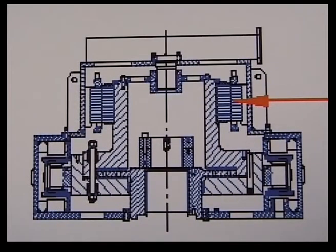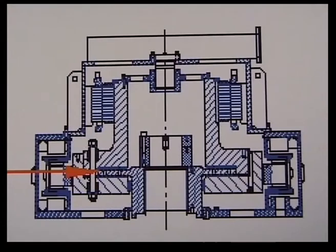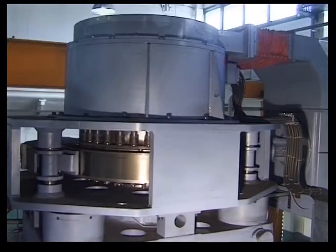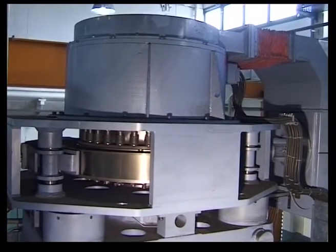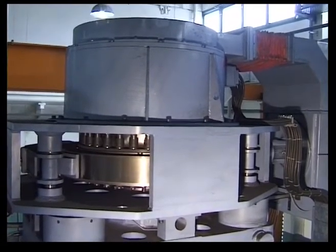The heart of the directly driven screw presses is the force-ventilated reversible three-phase asynchronous squirrel cage motor. It is directly coupled to the flywheel that acts as an energy store. In the SPR series, the flywheel is of compound manufacture and fitted with automatic overload protection in the form of a slipping clutch. The shoe brake, held closed by spring tension and opened pneumatically, acts on the periphery of the flywheel and is designed to brake the ram at the end of the return stroke and hold it until the next down stroke is released.